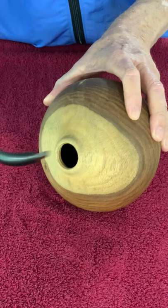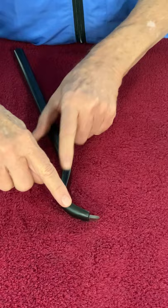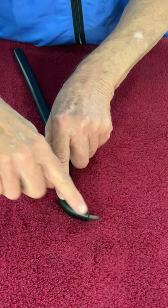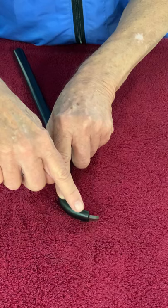The trouble with some hook tools you can get is that this section of the hook tool is made straight. While it may look like a hook tool overall, if this part is straight it won't allow you to get into that first little bit just under the lip, because it's just acting as a straight tool. This Holland hook tool has a continuous curve all the way out to the end of the cutter.